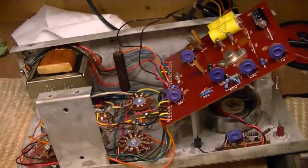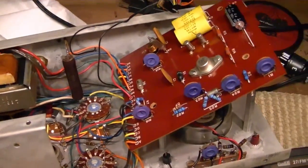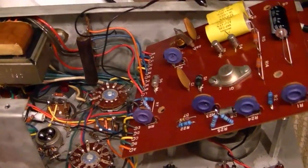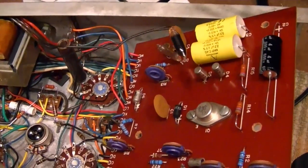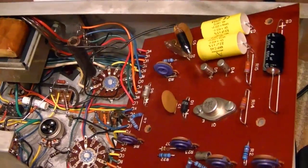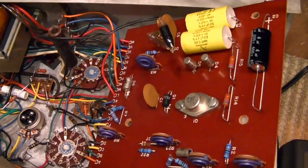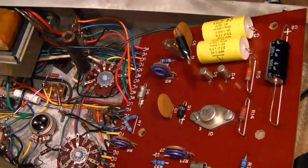Anyways, let's get that wire reconnected and see if it starts operating correctly. If not, I may have to dig up a new neon light bulb. I couldn't find much out on the lifespan of these, but I did see other people indicate having test equipment from about this era, and neon bulbs seem to be a common failure point.